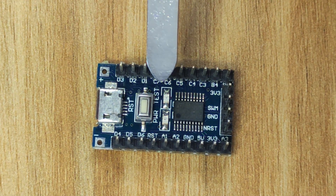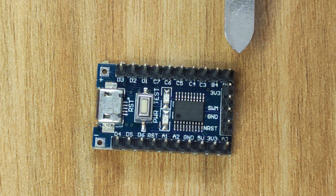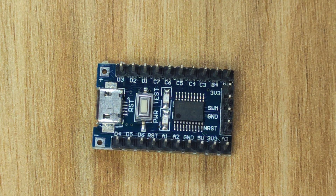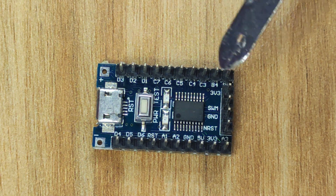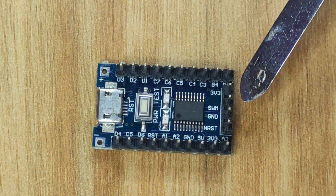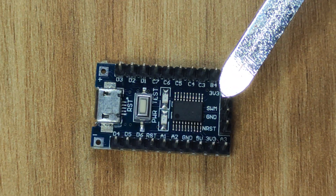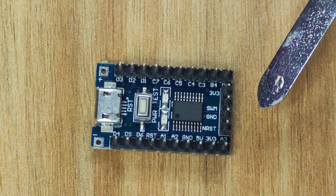You can see there's a test LED here — it's mapped to PB5, which is D3 in Arduino language. When you're developing in Arduino you map it to D3. There are also dedicated programming interfaces here — it's labeled as SWIM, which is nothing but a single wire debugging interface.